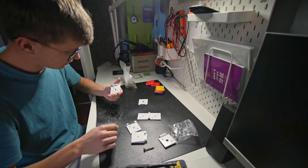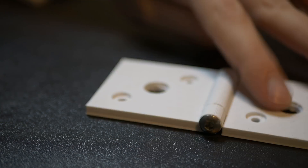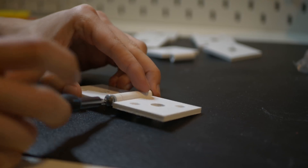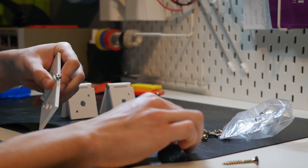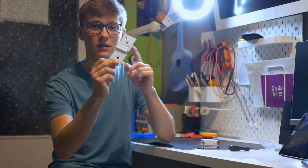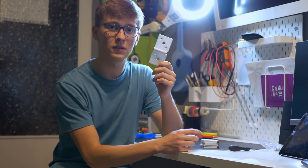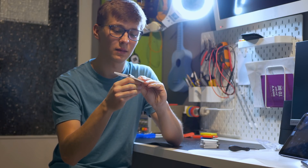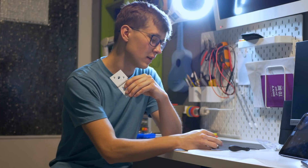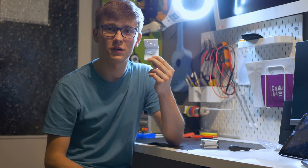I've got the screws, so we can start assembling now. To join the two pieces of the hinge I used M5 screws with quite small heads so they're not very visible. I had to sand down the holes in the hinge because I originally thought I'd use smaller screws to attach it to the table, but those are quite big. I'll fix that, and on Thingiverse you can find the proper STL file — there's a link in the description. Now you can simply attach this with big screws and smaller screws to the leg and table.